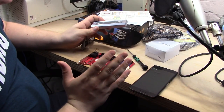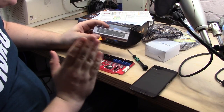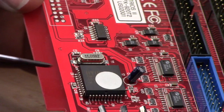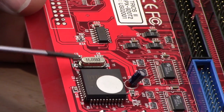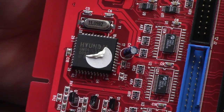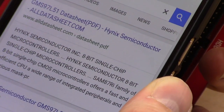You could build this out of transistors making D flip-flops and whatnot, but in practice, nobody did that after the 80s. So what this thing has on it instead is what I believe is probably an FPGA. This winner here is some kind of microcontroller or FPGA — you can see it has a timing crystal next to it, which means that it is a computer. I'm going to go ahead and peel this sticker off. We have a GMS97L51. Per Google, that is an 8-bit single-chip microcontroller. That's just a little tiny computer that keeps track of all the values. The fact this has a microcontroller on it means we're not going to find out exactly what it's really doing, because the microcontroller could be doing anything in the world.